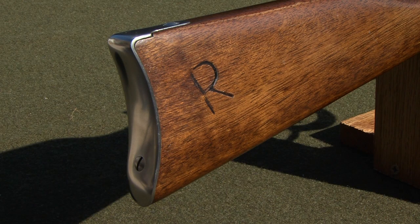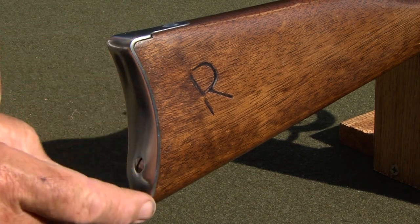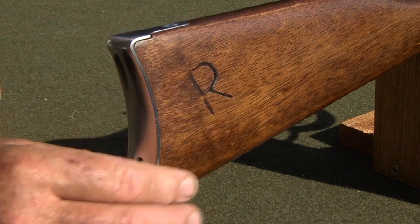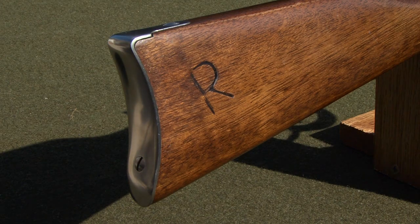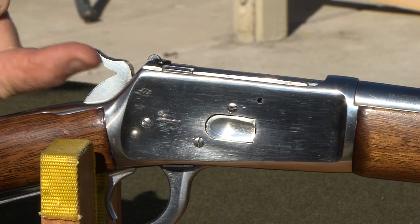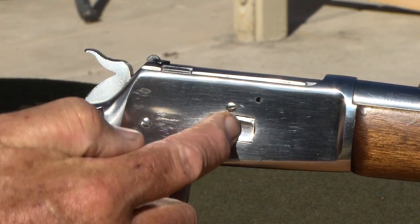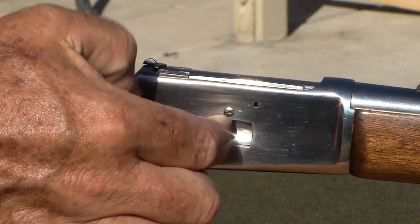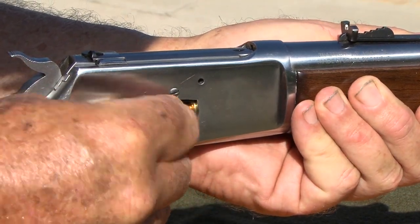While finishing the wood, I disassembled the rifle and began smoothing off burrs and sharp edges. The butt plate was sharp to the touch. Tender loving care with a jeweler's file and 500-grit sandpaper smoothed the rough edges. I filed off the rough edges of the hammer top and, most importantly, smoothed the outer and inner edges of the loading door with a jeweler's file and 800-grit sandpaper. Now I can load it all day long without peeling epidermal layers off my fingertips.